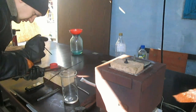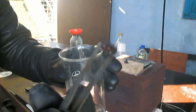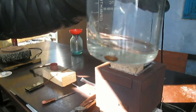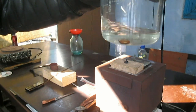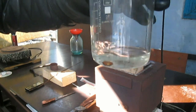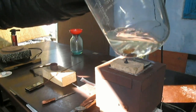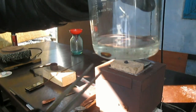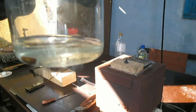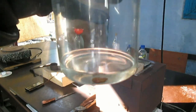In principle, here it is — done. You can take it. Our nugget. I'm putting it on the hotplate. I'll boil it in nitric acid to clean it, because when using iron sulfate, a little iron inevitably ends up in the sediment. The iron doesn't fuse with gold — it just gives the surface a slightly reddish, rusty, dirty color. Once it's cleaned it will turn yellow and beautiful. Done — it's smelted.